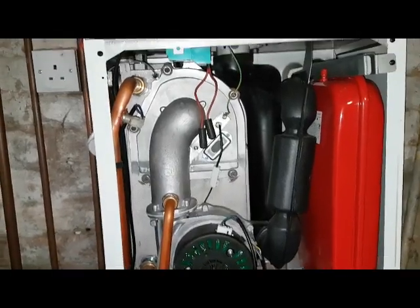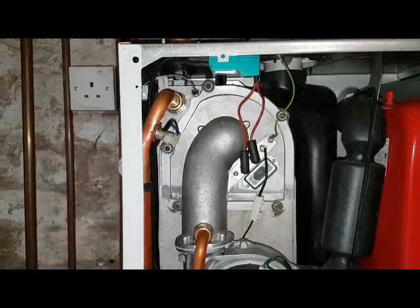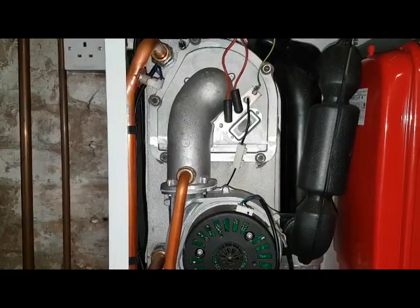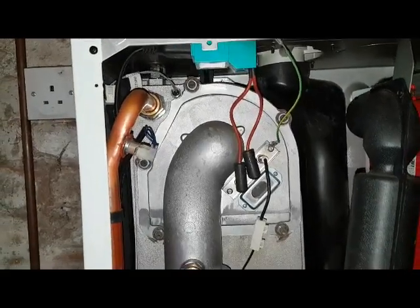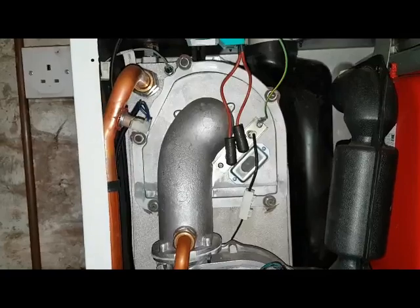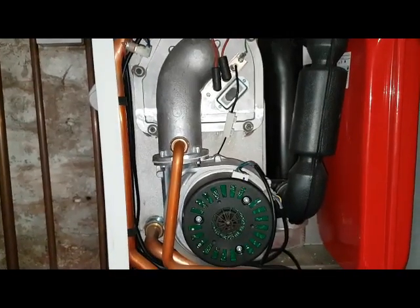In my opinion of the Main, I think the main heat exchanger here — the quality of it is not as good as the Baxi and the Pro Maxis. From my experience I've seen quite a lot of these fail due to leaking internally, because the metal alloy is porous. So that's a weak spot on the Main Elite boiler.